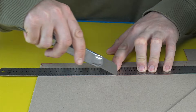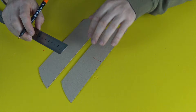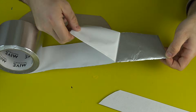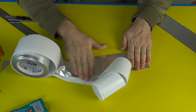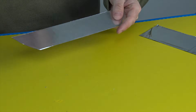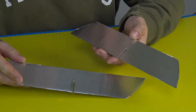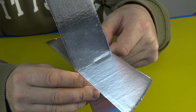But it's not as simple as it seems. Inside the plate and pipe, turbulent airflow forms, causing the air to accelerate and giving incorrect readings. Professional instruments use special internal vanes to stabilize the flow and evenly direct it onto the measuring blades — we'll make them ourselves out of cardboard. To minimize the effects of static electricity, we'll cover the vanes with aluminum foil. Moving air can electrify dust particles, which settle on the blades or motor shaft, creating resistance and distorting readings. Aluminum, thanks to its conductivity, dissipates static charge, ensuring precise and stable measurements.